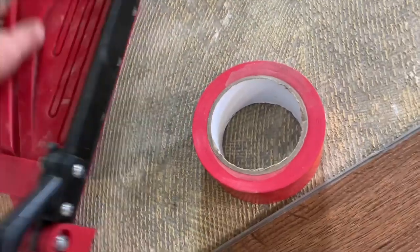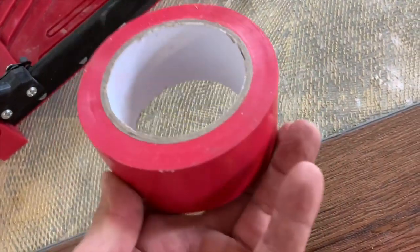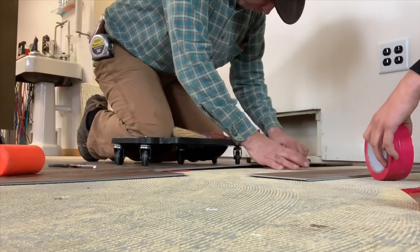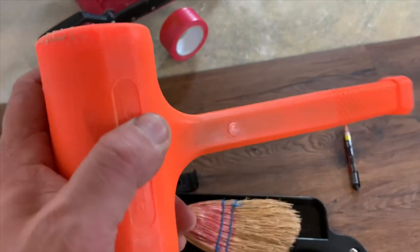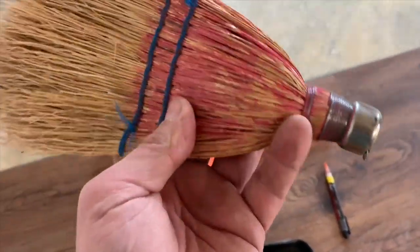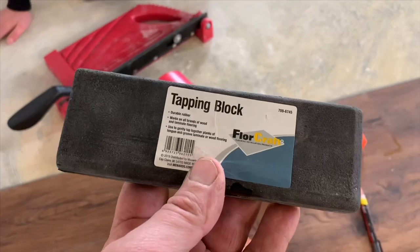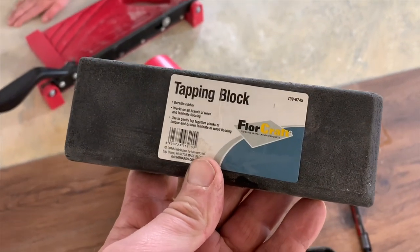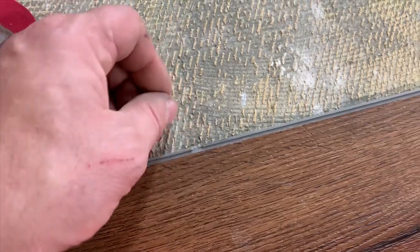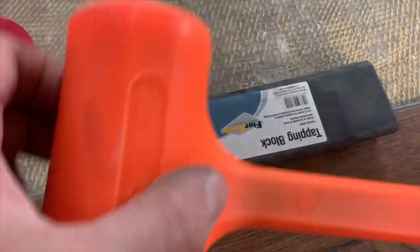That cutter will save you from using a chop saw all day long. If you're in a high-traffic area, you can use underlayment that goes upside down and just glues a seam together. I'm using a dead blow hammer and finding that works really well instead of a rubber mallet. I keep a whisk broom around — that makes it really slick, just sweeping everything out nice. This tapping block is a game changer, because if you tap directly on the flooring you'll break that edge — it's very fragile stuff. You put the block on and then you can really tap on it.